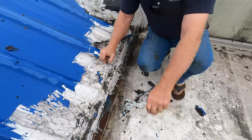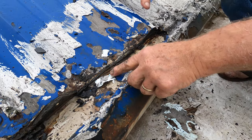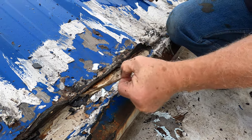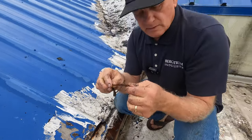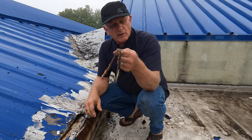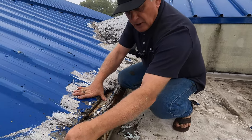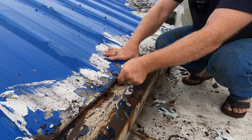The next no-no is never use caulking. This caulking — that's the first thing they did. They used caulking. It's rusted. Look at this caulking, it's not holding. All these caulking companies say 50-year warranty — there's no such thing as a 50-year; it's not even a one-year warranty. Never use caulking to seal a metal roof. This caulking is just sitting loose there. It's not holding.